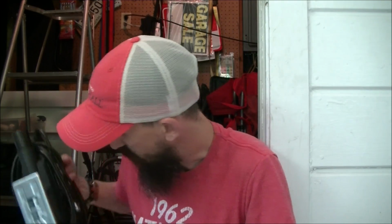I had to get a jigsaw because I don't have one, and this is to cut first the strips of wood, and then also to cut the general shape of the board once we transfer the template and it's all glued and dry. So I got this jigsaw, the cheapest one, $22 at Harbor Freight, links below, and I got a little kit of blades, and I used a rough blade right here to cut the strips, and then we'll use more of a finishing blade to cut the shape of the board once the glue is dry.